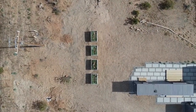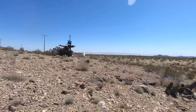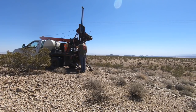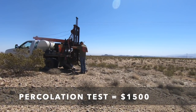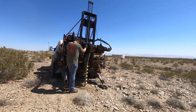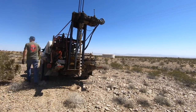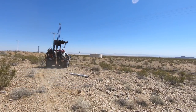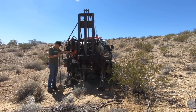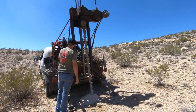Using these above-ground concrete planters wasn't our first idea. Originally, we thought we would do a very conventional septic system where the effluent just drains by gravity into a leach field. But in order to get a leach field system approved by the county, you have to perform a percolation test that demonstrates that the soil on the property can safely handle the effluent. This is done by drilling holes deep into the ground and seeing how fast water disperses. We tried a bunch of different locations on the property, but we kept hitting rock just about a foot or two beneath the surface. We finally found a location where we didn't immediately hit rock, and it was really cool to see how this giant modular drill bit snaps together so you can keep going deeper and deeper.